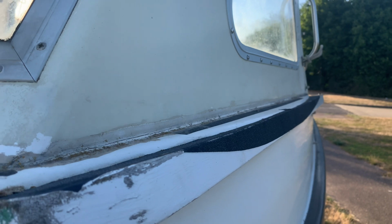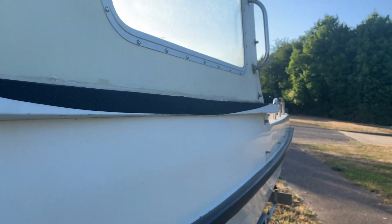And it's little things like that really that show that these boats aren't made by professional boat builders. Yes, they were probably laid up by a professional boat builder, because it's an incredibly good finish, mostly on the inside. And the fiberglass work is really top drawer. However, the finish isn't. So there are things that are missing. There are things that have been sort of screwed on, and they haven't used washers. They've used bits of wood. So yeah, it's been made by a professional out of a mold, but then it's been finished and modified by someone who's been trying to make their own fishing boat.